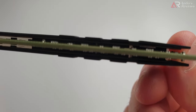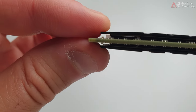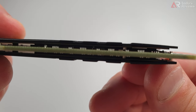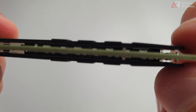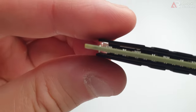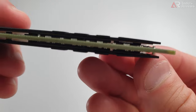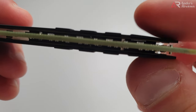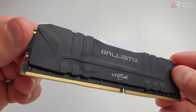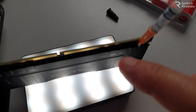You see this Ballistics memory module - on the sides there are gaps. I pressed into the radiator and on both sides there are gaps between the chip and the radiator. If there is a gap, there is bad cooling, and these gaps are very big, meaning the side chips are not actually being cooled well - very, very bad. The contact was okay initially, but after reinserting the memory module maybe 10 to 15 times, pressing on the radiator multiple times, it just got disconnected.